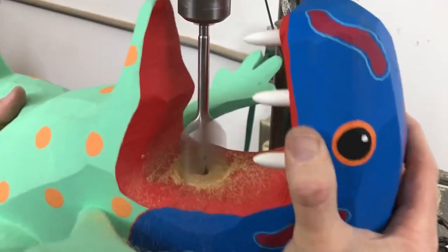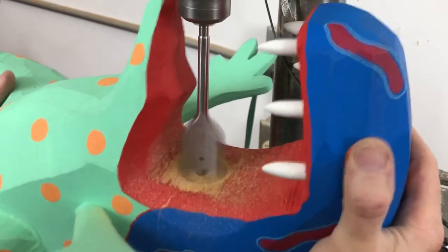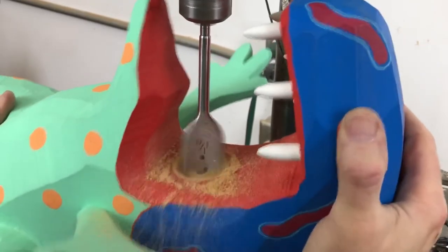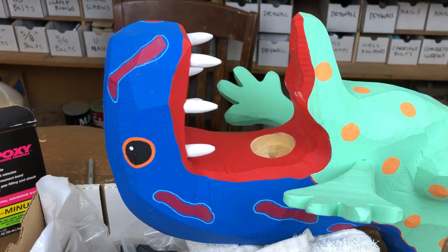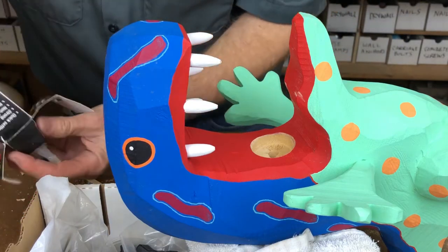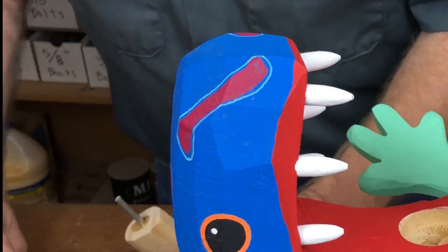The reason I'm fighting it so hard, aside from the runout in that bit being ridiculous, is that I'm cutting end grain. Bottom line: I'm trying to machine end grain, and boy that's tough. That was pretty brutal. I wound up having to hog that hole out into a pretty irregular hole because it was really the only way I could do it — then I realized it was actually to my advantage. So let's break out the five-minute epoxy, because without five-minute epoxy there's no life.